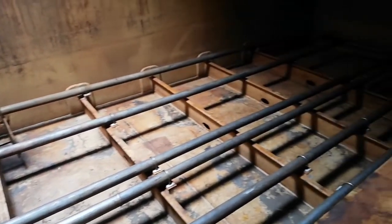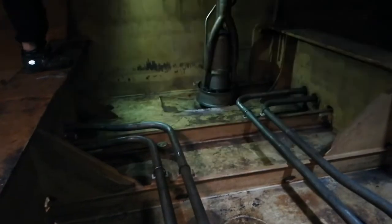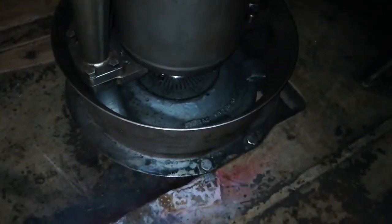At the bottom you can see the steam line. These heating coils are used to heat the cargo inside the slop tank. Here you can see the framo pump, which is used to discharge the slop. And here you can see the discharging pipe and the hydraulic pipelines.